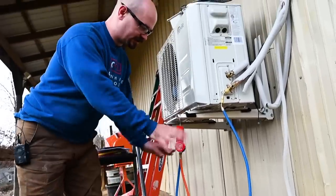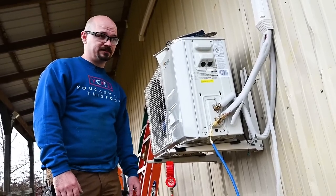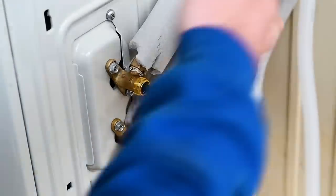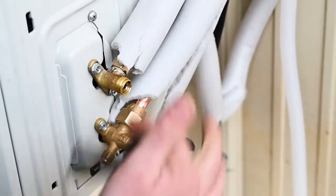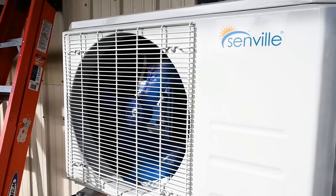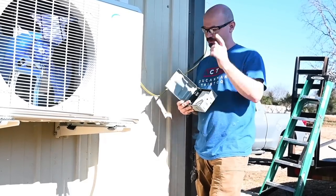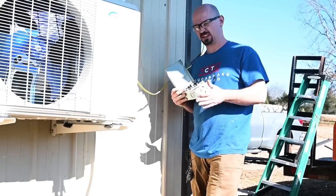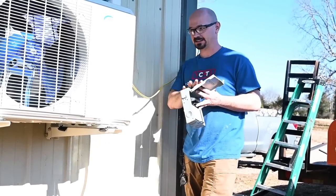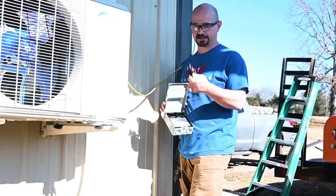Time to release the rest of the refrigerant. I'm going to disconnect everything first and then add electricity, and we'll have heat, air, fan, dehumidification — whatever we want. Just to test the unit I ran some Romex — everything works. We've got a little trench started because I'm going to run this conduit underground. Just need to slap on my disconnect boxes. Code requires a disconnect beside any unit so service techs can make sure it's disconnected when they need to service it.